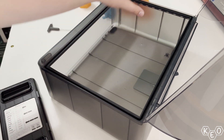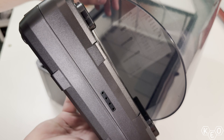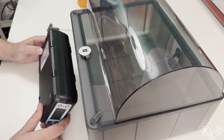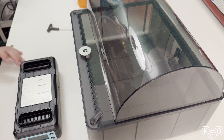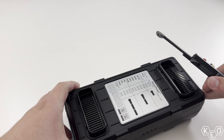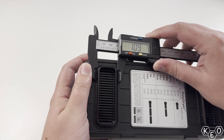With everything out of the way, I got a better look at the box to scout a location for my ports. I decided to put the base down, use some ducting, drill some holes, and connect it all that way — redirecting airflow from the base into the box via the ducts. The sides of the box were a little too thick, the lid had a complex curve, and the flat sides of the lid couldn't really accommodate the dryer's size. The front ended up being the only real viable option to mount the dryer. With the location scouted, I moved on to measuring the outlets from the dryer so I could make ducts that would connect them to the dry box — they needed to fit snug to direct as much air as possible.